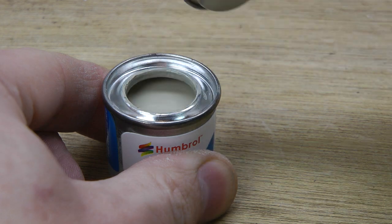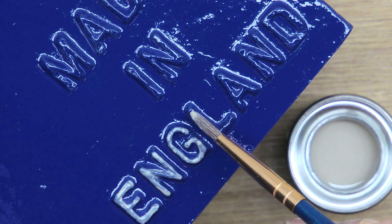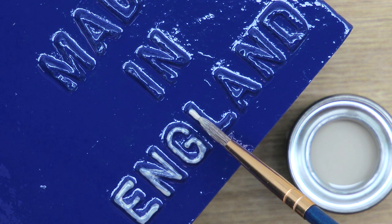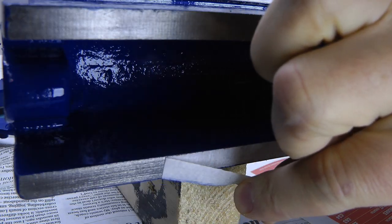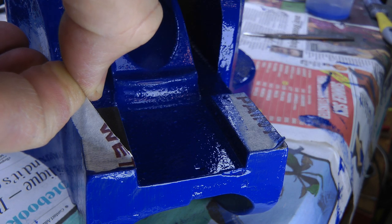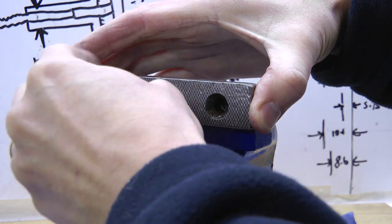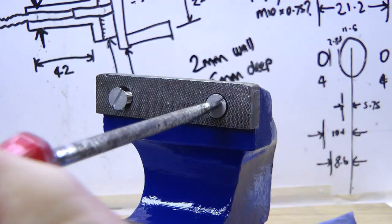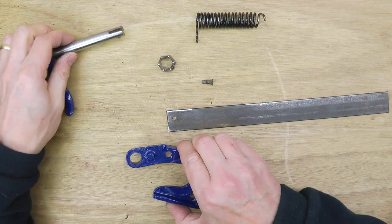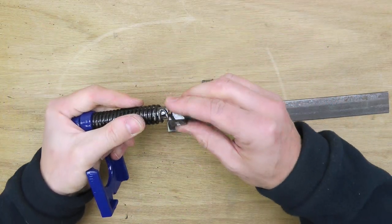Record stuff doesn't usually have the lettering outlined, but 'Made in England' isn't something you see much these days, so I thought it deserved highlighting. Once the paint was touch dry I removed the tape and gave it a couple of days to fully harden before I started reassembling. The jaw plates went back on with new slotted screws. I reassembled the quick release mechanism and left the spring loose so I could re-tension it when it was back in the vise.